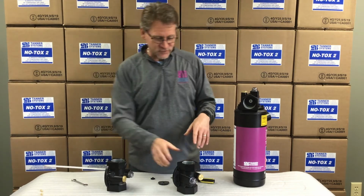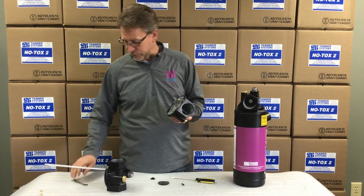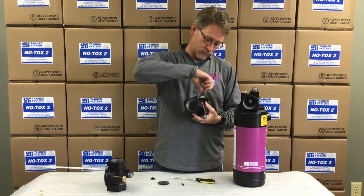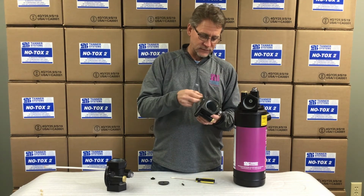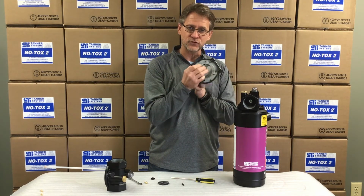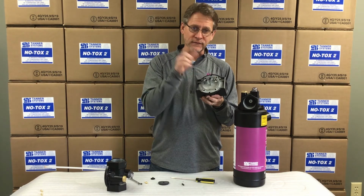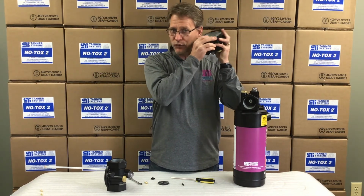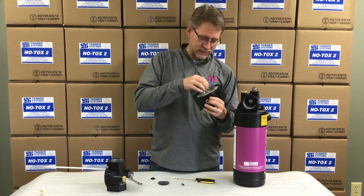As long as you have the siphon tube off, you might as well just check the underside, the O-ring and the ball that are in here, and see if that is all okay. Is there any contaminants underneath that adapter? There's an R51 O-ring in here, and on the other side of the O-ring is a little ball check that works as a backflow preventer. You can shake it and you can hear it rattling there, and that's a good thing. So if that's rattling and if it looks really clean, you're great.